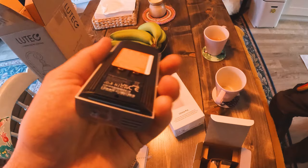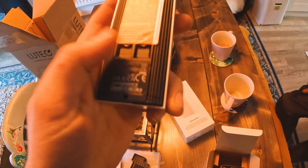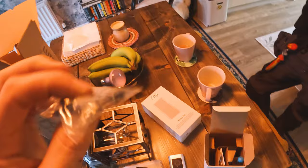That's your Ring doorbell then. A little screw just holds it on - going to get a little screwdriver. Just pop the back plate away from the front plate. You get some quick start instructions. If you want to use this with the original doorbell, you can use this. But of course the original doorbell's right tucked in to this pillar.